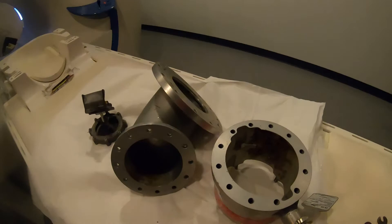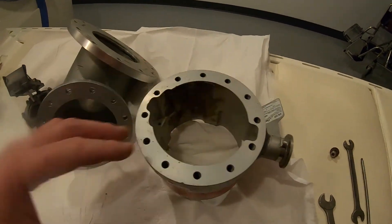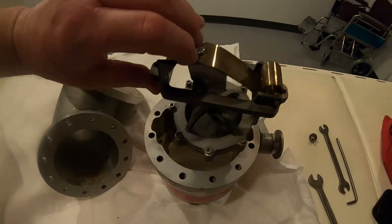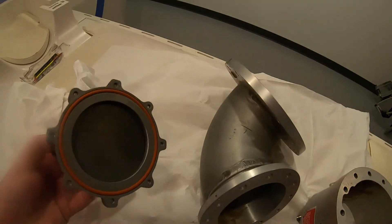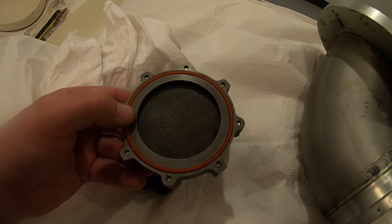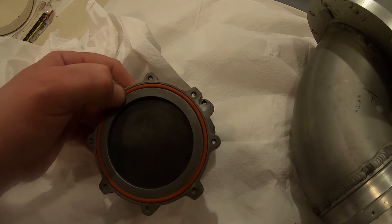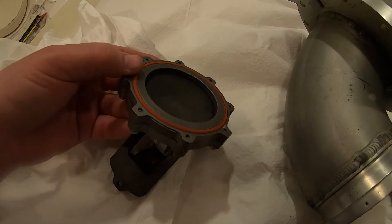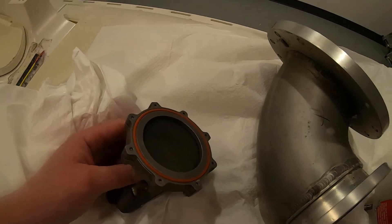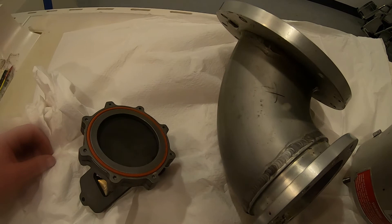We got everything out. This is the quench vent assembly and this is the actual burst disc — it sits inside of here. It wasn't actually broken. What ended up happening was, because the button was pushed in for so long, this O-ring froze up something fierce and was completely compressed with no give to it. I put it out in the sun for about 20 minutes to let everything warm up. I'm going to put it all back together and then we'll show you whether we're getting pressure or not. Stick around.